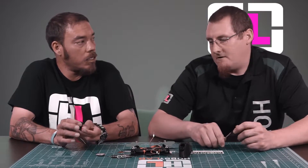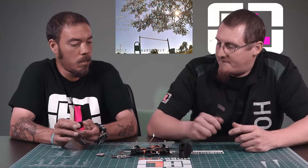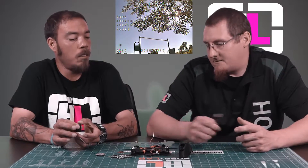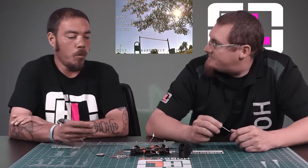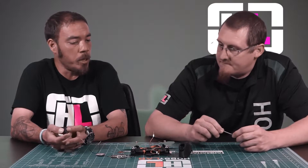It's got a couple of cool features. First of all, it's controllable through the OSD. It's switchable from 25 milliwatt to 200 milliwatt, and it does the standard 40 channels — all controllable through the OSD. No dip switches, push buttons, or lights to look at. We had really good luck with range. We paired it with a patch antenna and were able to go about 200 yards out with very little issues.